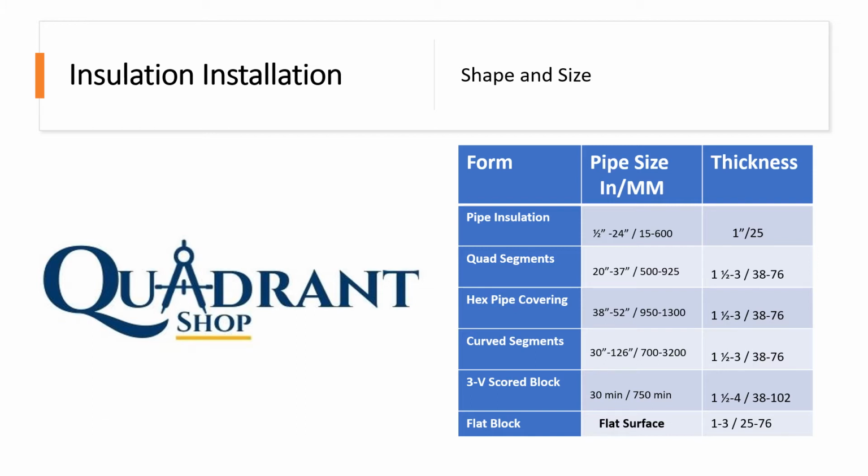So let's look at this graph we have right here of different pipe insulation for pipes, for tanks, for bigger pipes, for tank farms. Let's say tanks that are so big that they don't have a curve, it's straight up flat. Pipe insulation, most commonly, all distributors carry it for 1.5 to 24-inch pipe. You could find insulation for those pipes almost anywhere. The thickness is up to 3 inches. If you want anything above that, it's basically going to have to be special order, or double layer.